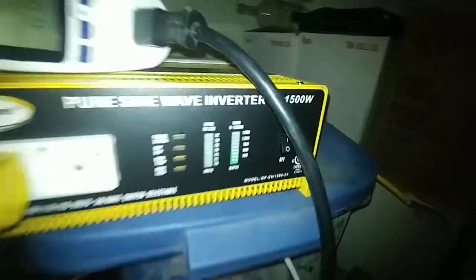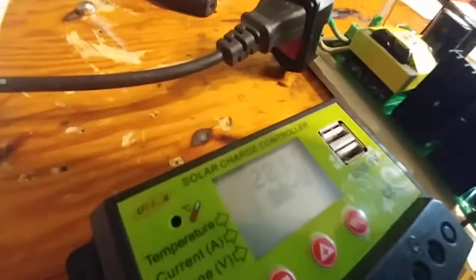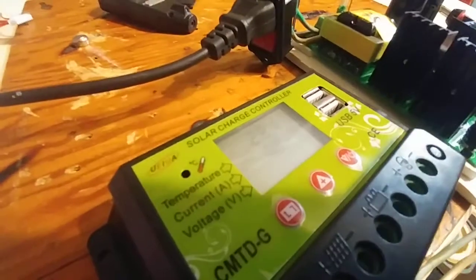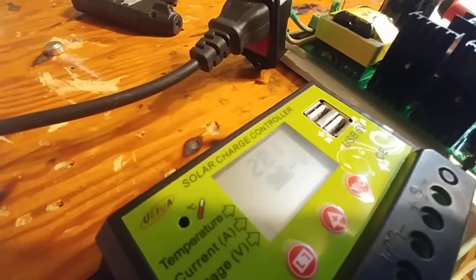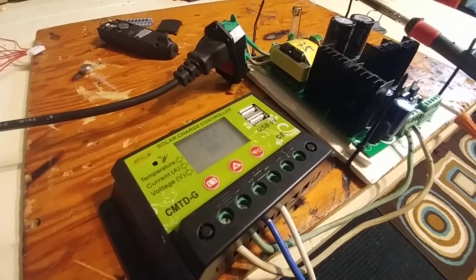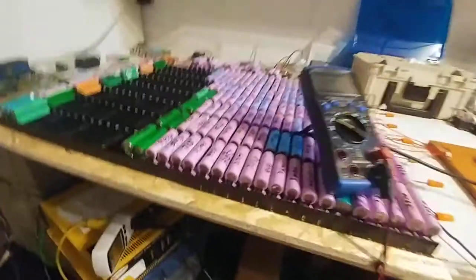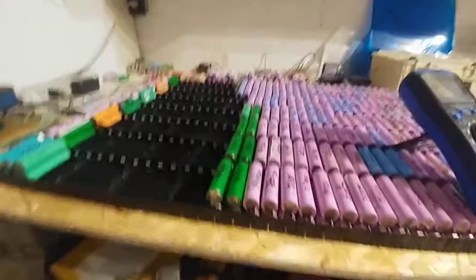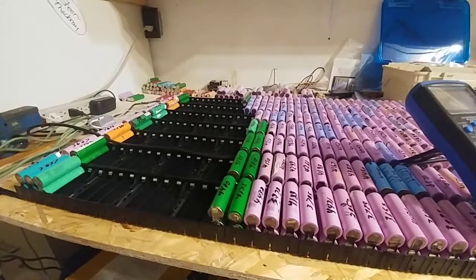Here's a cool thing. I'll turn it off — it was at 27 volts. I forget the terminology for this, but from my crystal cell battery research I encountered this as well, where the voltage just pops back up slowly. See, it's already gone up — it was at 27, now it's already at 28.2 right away. It looks like it's charging itself up, but it's not. It's just a phenomenon of batteries — they're just trying to resettle from such a high current drain.